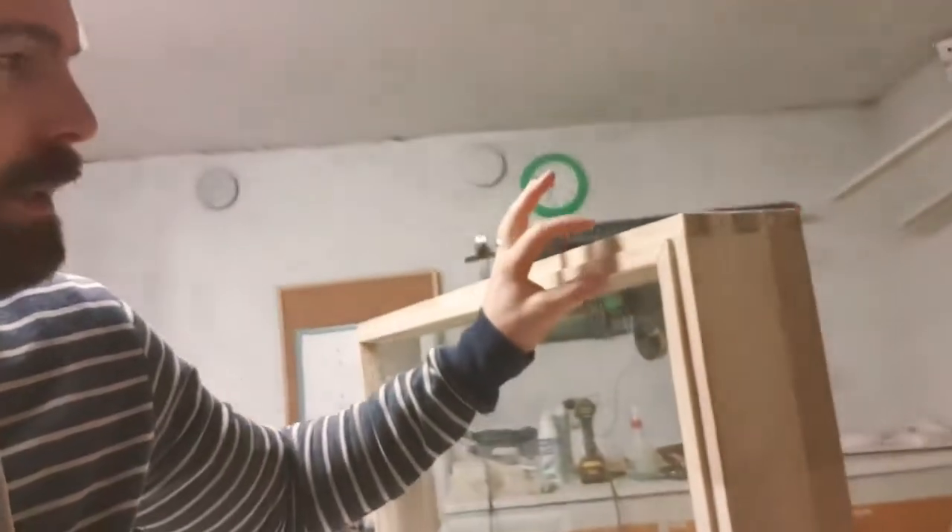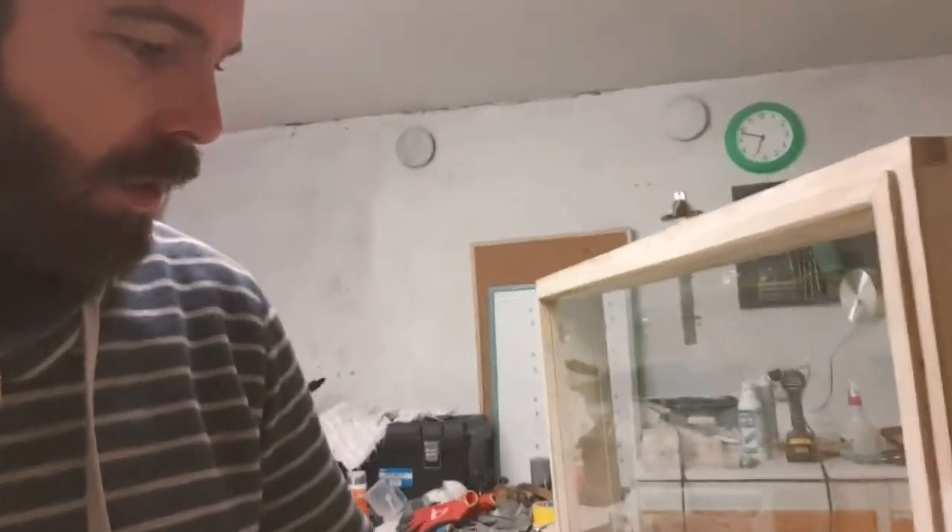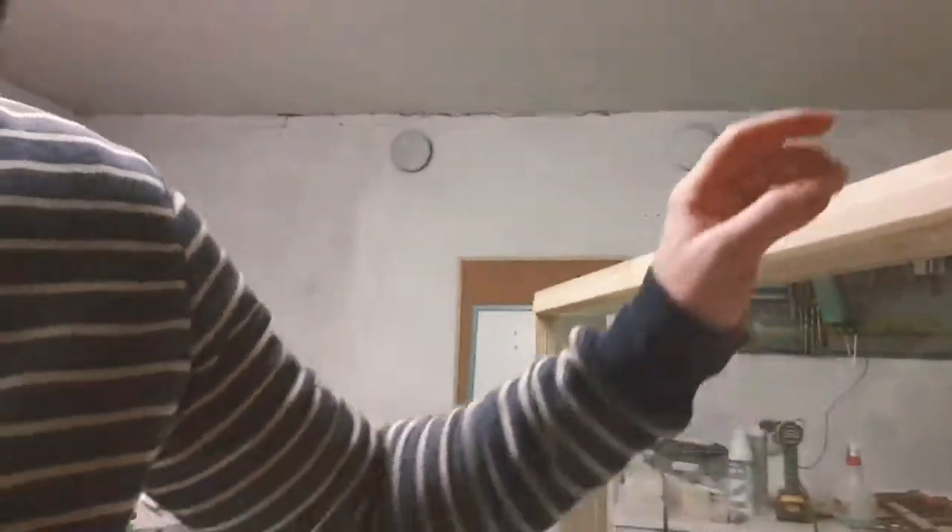You might wonder how much it cost to build this. I bought the glass for the window — it's from a table — for about 40 euros. This is oak wood, which is a little more expensive than spruce or pine, but I wanted oak because it's a harder wood and easier to work with for this kind of project. I wanted a narrow frame, and with spruce I might have needed a thicker frame. The weather strip and acrylic sealant were maybe five to ten euros together. So in total, about a hundred euros to build this window.